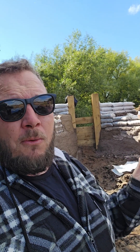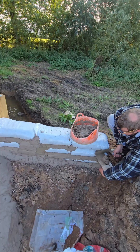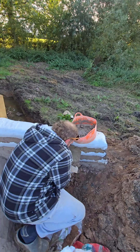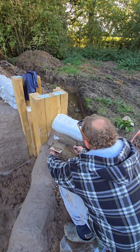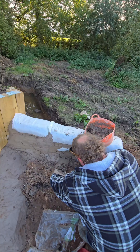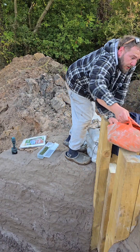I've got plenty more sandbags to fill when I'm doing the castle, so if you've got any ideas on how I can improve the strength - I had thought about fibres in the render or something like that - let me know in the comments. It's the final step of building myself a dam, I've just got to render these top bags. Such a small wall, I wasn't really anticipating it being a problem, but because of where it is it's awkward to stand next to. My splash method is letting me down because my mix is too dry. I've gone and bought myself one of these fancy air guns that blows out render, so hopefully I'll do this much faster. With all the sandbags to do on the island to build the castle, it'd take a hell of a long time to do this all by hand. This mix is a little dry so I'm just going to point the gaps in the bags first.